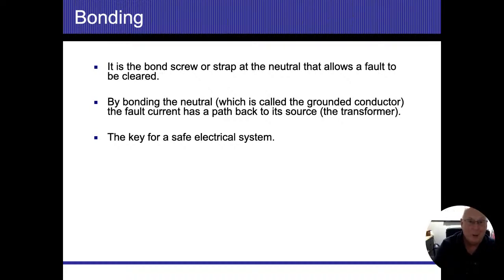So as I follow that out, if I run into a junction box on my ground path, I should be suspicious. Those are going to be the areas that I'm going to open up. And if you get inside that thing and you see your GECs are spliced together, that's a problem because we're not allowed to splice those whatsoever. All right.